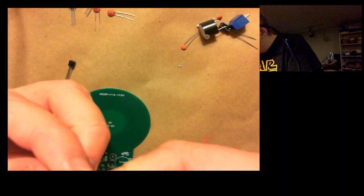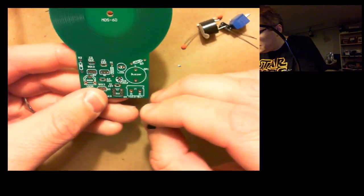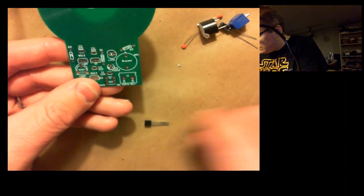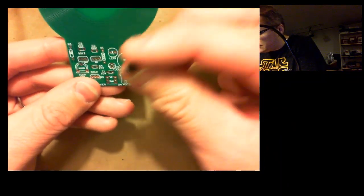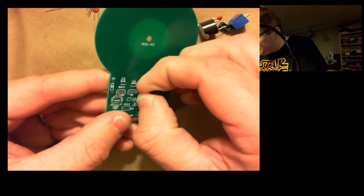So this one here is the 9012. This one here is the 9012. So this is the non-9012 one. It is the, my eyesight is failing, 9018. So I'm going to assume that the shape of this white outline here indicates which way I should put on this transistor. I'm saying it roughly matches the curve of that, so we'll just poke those three right into that hole there.